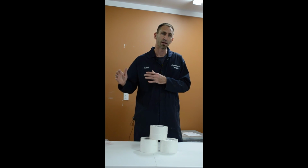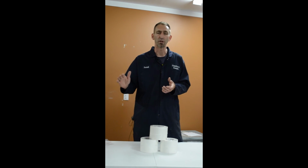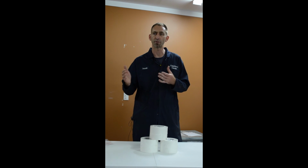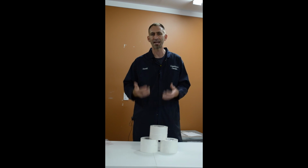But I would recommend that if it's at all possible, and I would say that 80% of the time it should be, that you would tape that floor and that wall seam together before you drill those holes, so that after you drill the holes and you go to clean up that dust, it's a matter of sweeping it up and vacuuming it up, and it's not as critical to get every last little grain.